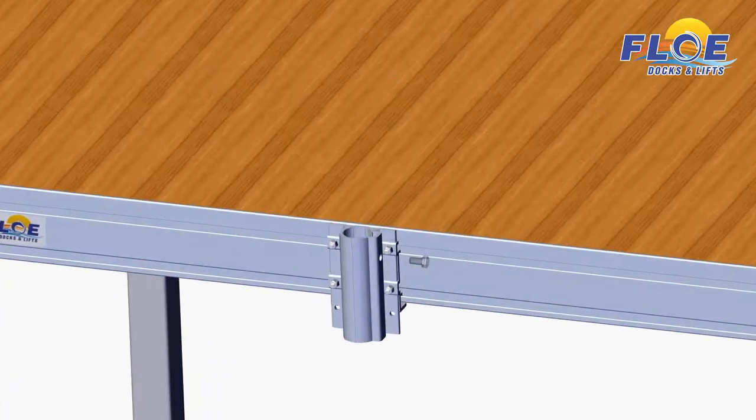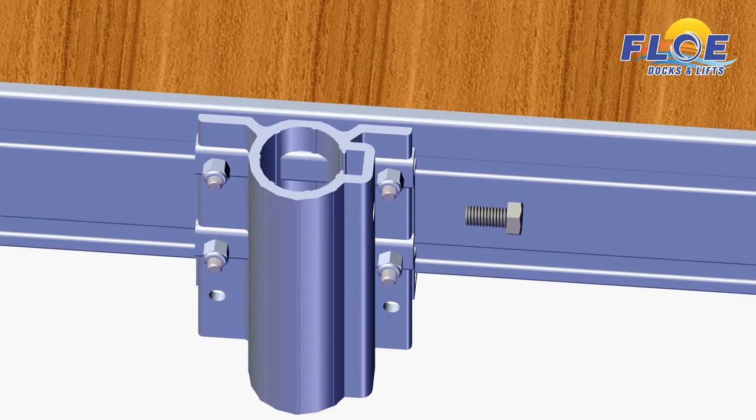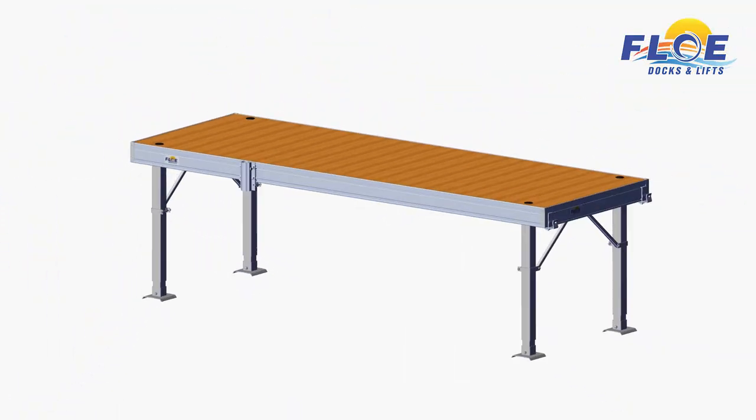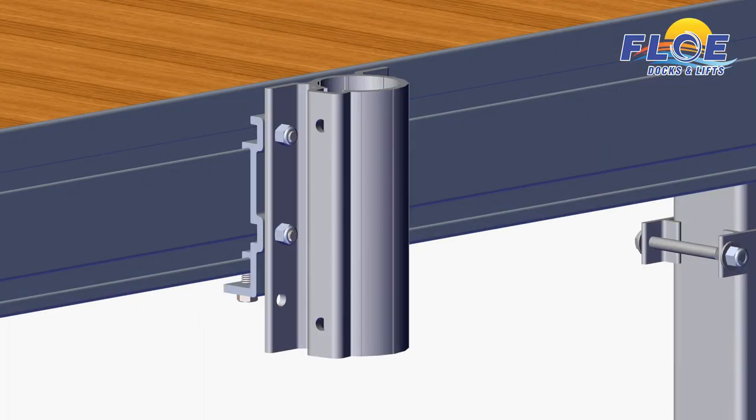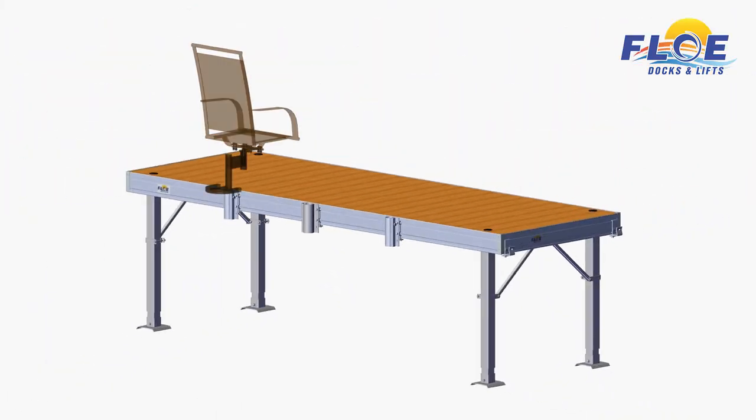Insert a half-inch nut into the pocket channel, then thread a one-inch bolt into the nut to hold it in place — just get a few threads started at this time. Tightening the set bolt will come later. The table pocket will not need this step done because the nuts come pre-installed into the table post. Repeat this process by measuring 31 inches and adding another quick attach bracket for the table, then measure another 31 inches and add another quick attach bracket for the other chair. Add a table pocket to the center quick attach bracket, then add a chair pocket to the last bracket.